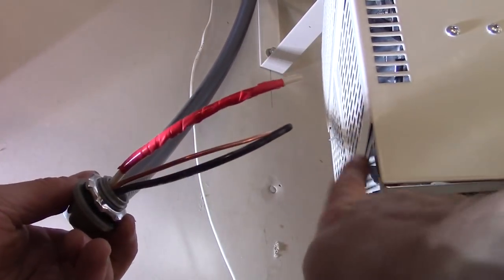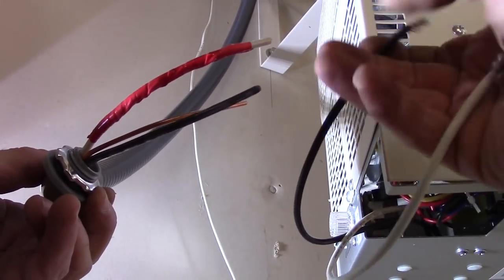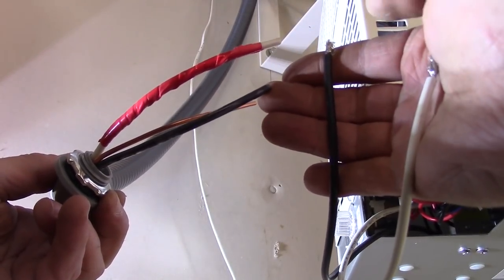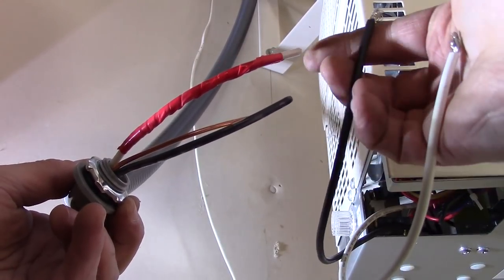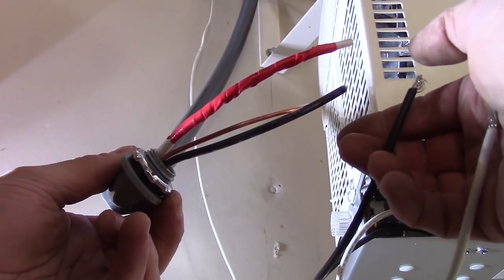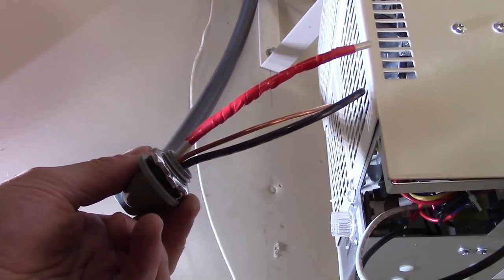What we're going to do is go ahead and use wire nuts to wire them up. Keep in mind, there's no real polarity when you're talking about 240 volts — we're going to go black to black, white to white, but honestly they could be either way, because each of these wires is going to be carrying 120 volts. We'll talk about that more when we get to the panel. I need to get that plate, because the plate needs to go on first.